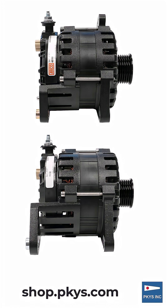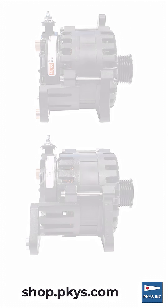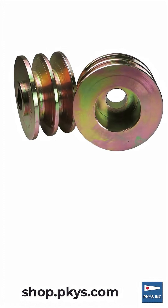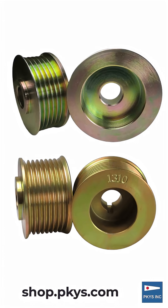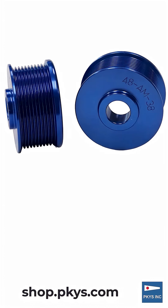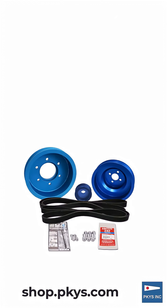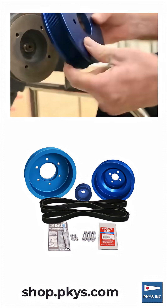The third critical factor is the pulley type. The alternator pulley must match the pulleys on the engine. While a traditional single V pulley is common, it won't work for high-power alternators — it simply can't handle the required amount of load. For more powerful alternators, you'll need double V belts or a multi-grooved belt. Common choices include K6 or K8 pulleys, with K indicating the groove cut and the number showing the ribs. We also have J10 belts with a J profile and 10 ribs. If your engine doesn't have suitable pulleys, don't worry — it might be possible to add a conversion kit, which is available for many popular marine engines.